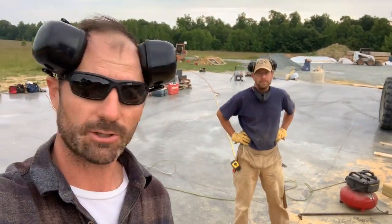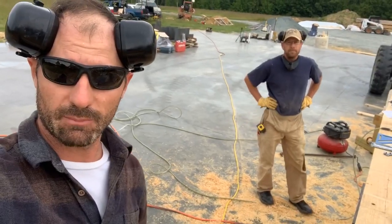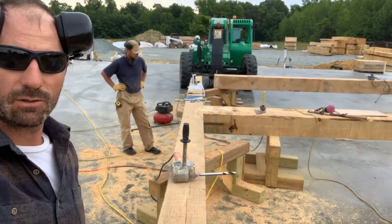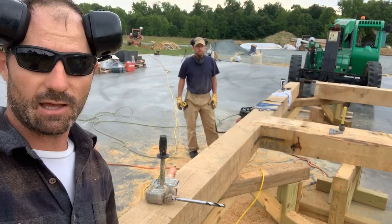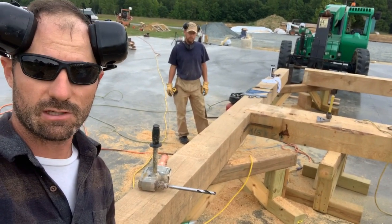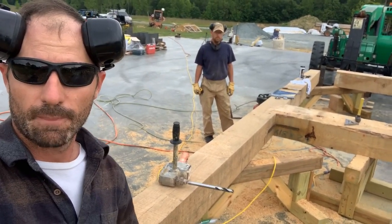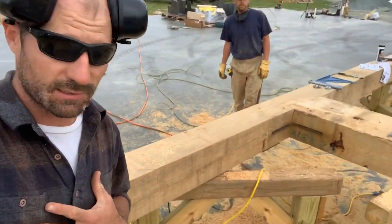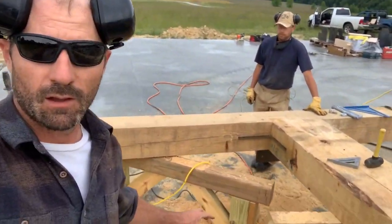What's up y'all, Logan Parker and Mike Heindel with Heirloom Builders. Today we're timber framing with heavy timbers — post and beam style joinery. The difference between timber framing and post and beam is that these joints are made with steel connections: steel knife plates and galvanized carriage bolts, instead of dovetail wood and wood peg joinery. I think this is actually a much stronger joint and it's a little bit easier to assemble.